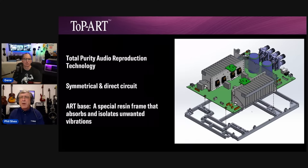And then they're special, they're custom. The 2000 is custom built, expensive custom built. These are custom spec'd in the 1000 and down. They are built to our spec, but the other ones are very expensive. And the advantage of that, again, is low ESR. You just have less power supply ripple, less noise.